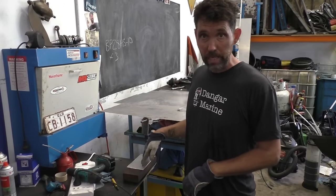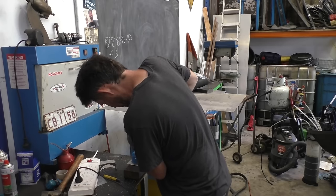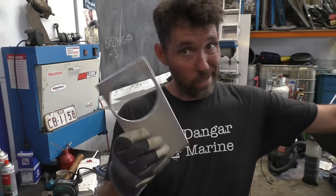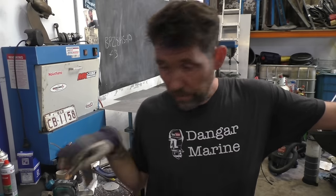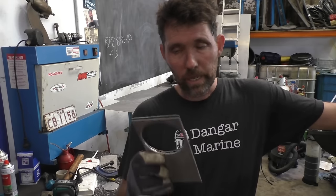I'm going to drill this new plate on the bench by clamping it to a block of wood. What went wrong is that the original centre drill bit for the hole saw had broken, so I replaced it with a 6mm drill bit — calipers showed it was actually 6.2mm — and I ground a flat side on it for the grub screw. But it's not true; it's wobbling inside the hole saw, making the hole larger than it should be. The lesson: don't fake it — buy the proper centre bit for the hole saw.